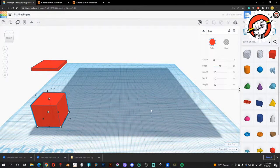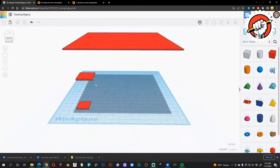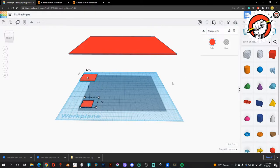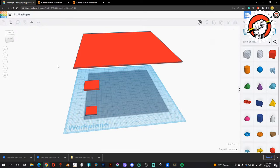Throw down another block — this one is going to be exactly one millimeter tall, because we're going to cut it out of the bottom plate. Every single grid square is going to be around 25 millimeters. I'll keep this guy around 20, which gives me about a 2.5 millimeter overlay. We'll take these two, use the align tool to center them together, and then group them.